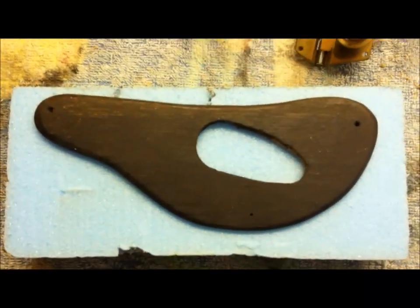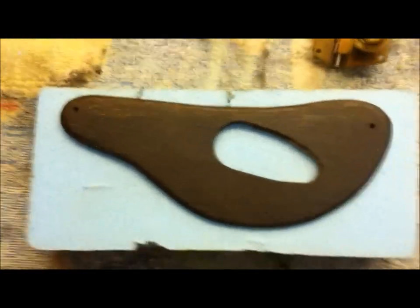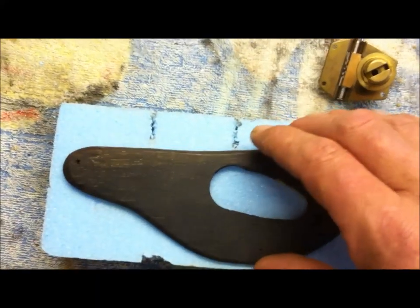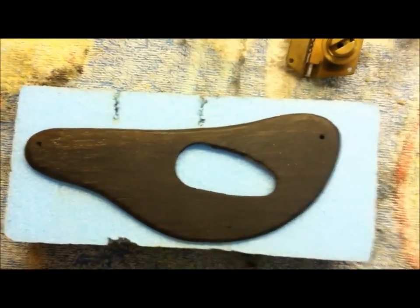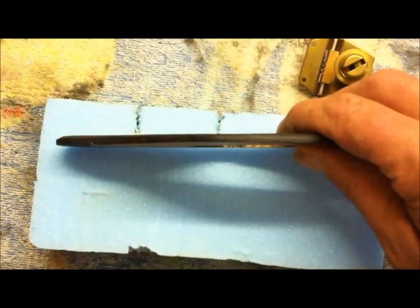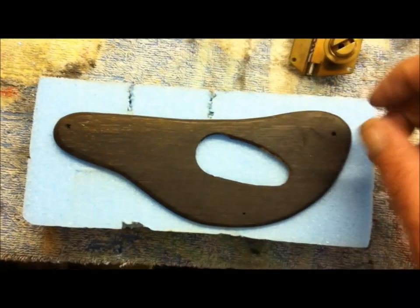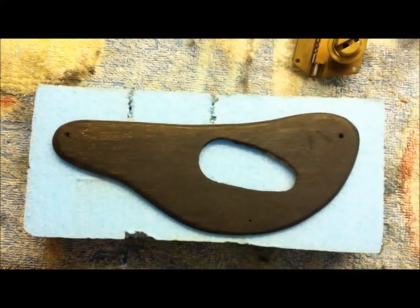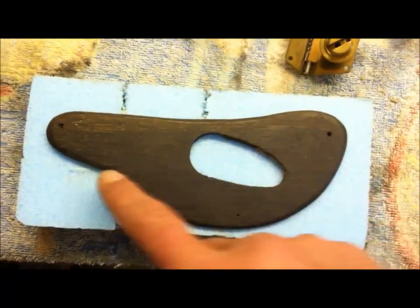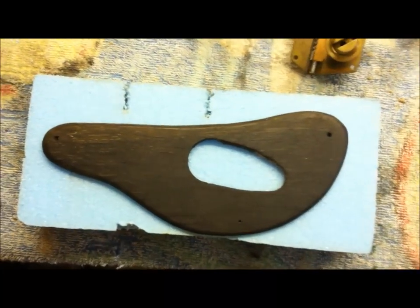And if all goes well with this, I'll do the body black like this. This is actually a piece of oak - I just stained it with wire wool and vinegar, it's a very simple stain. The only thing that worries me about this is it's quite thin. When the aluminium sets - not dries, it's not paint, it's aluminium - when it sets, it tends to shrink, so where I pour it, it might shrink.